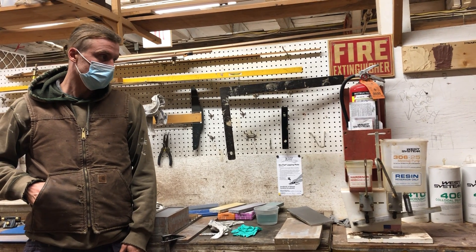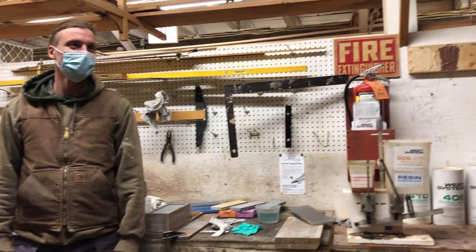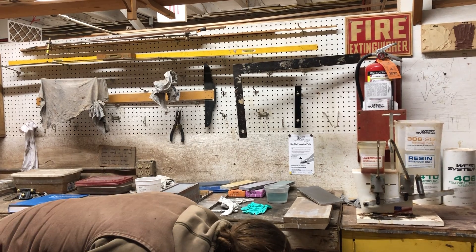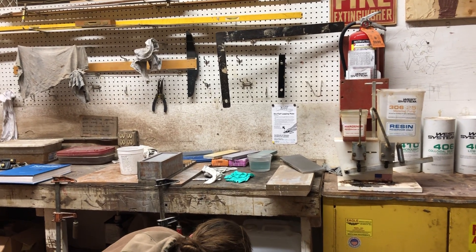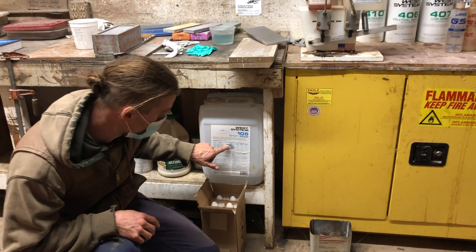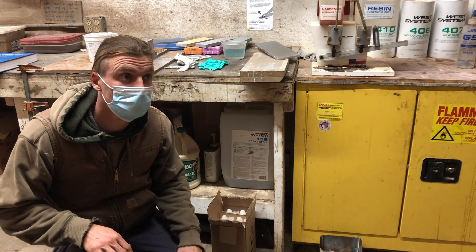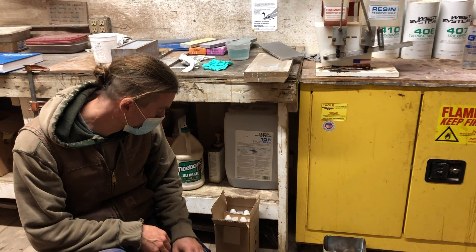Without doing a big lamination in front of you I'm not really able to relay this very well. The resin in here is their base resin — that's the 105 — for everything with the fillers and things. And even though you have the resins and the hardeners, this gives you the fast cure, slow cure, extra slow cure, and the clear. These are the different hardeners you can mix with it, and their temperature range, pot life, working time, and cure to solid are all covered. They have a huge amount of information on all the packaging, which is really convenient.